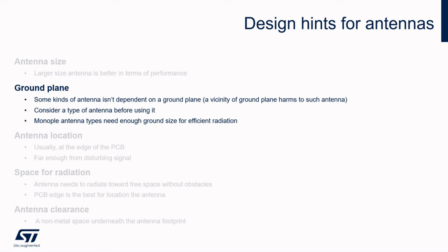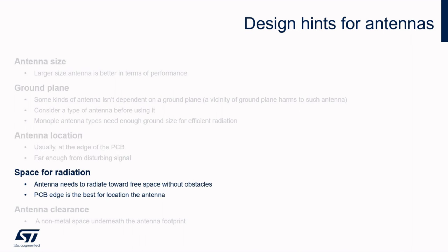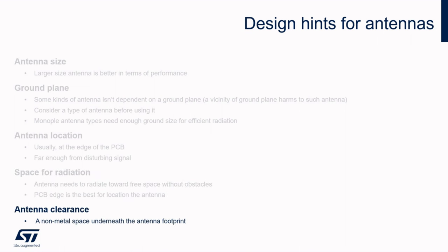Vias in the ground around the clearance must be placed as well. Antennas should be placed at the edge of the PCB according to the recommendation of the manufacturer — however this may not always be the case. On the contrary, a microcontroller is better placed somewhere farther from the edge, as it needs components and appropriate routes placed around the MCU. In front of the antenna there should be no obstacle that would obstruct the radiation — it can be a metallic object. Select a place according to the recommendation of the manufacturer. You should also consider the mounting or varying side to choose the best direction. Clearance is the space on the PCB underneath the antenna footprint where no metallic plane, trace, or object is present. It must be defined for the antenna according to the manufacturer's recommendation; decreasing this clearance causes smaller performance of the antenna.